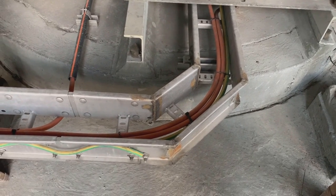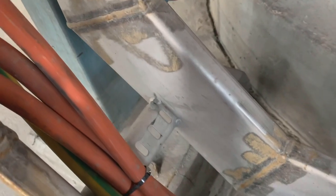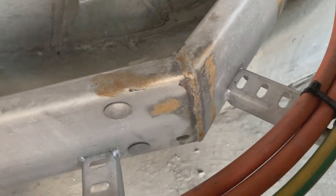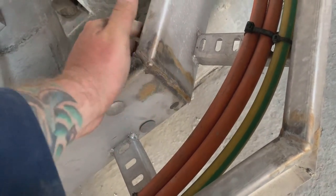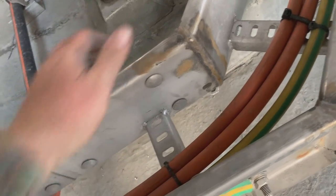This is what happens when someone puts a mild steel grinding disc in the pile with the stainless steel grinding discs. There may not be a difference in the grinding discs themselves, but one's impregnated with mild steel and it will give you a hassle later on when some poor bastard has to go along and sand off all the rust. Because dissimilar metals will rust — I don't care what grade stainless you've got, it's gonna rust.